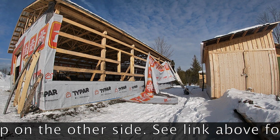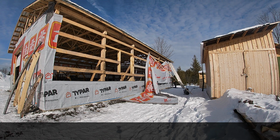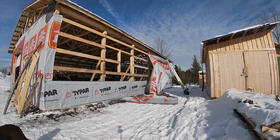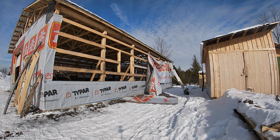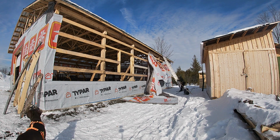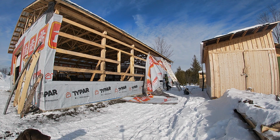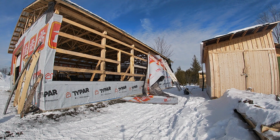So here's the footage of me using two ladders and a piece of wood to essentially hold the sheet in place while I was stapling it in place with my air stapler. With the two ladders, I get it up in place and then I slowly start working my way left to right across about a 6 to 8 foot section. Get it stapled in up top, and then you'll see me start working down the side of the building to get the building wrap in place.